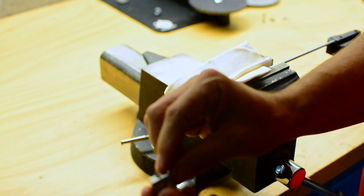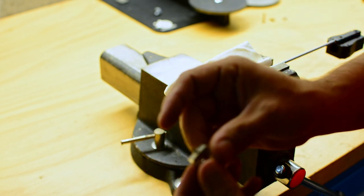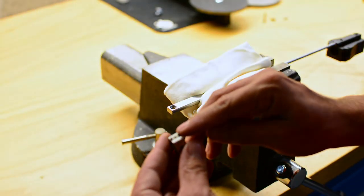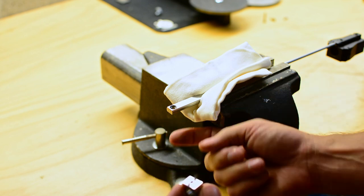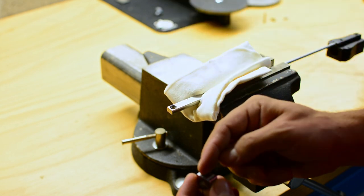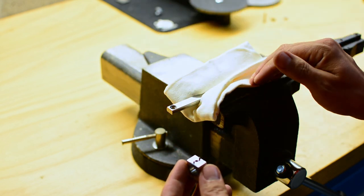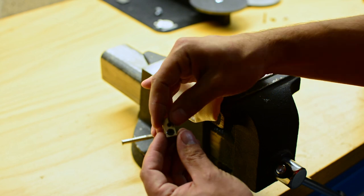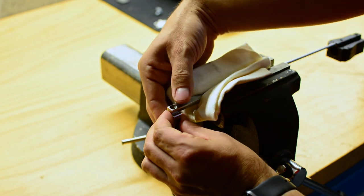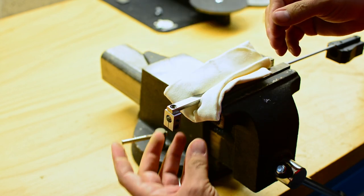That probe has some alignment pins. It seems like there is no second pin, so I'll quickly put one in myself. I now have both pins reinstalled. Those two pins line up with two holes in the bottom of your cocking rail — these two pins ensure perfect alignment so your pellet probe goes in perfectly in line with the barrel. Put them back in. Make sure you put your screw to this side with your block to the front. Locate those two pins and make sure they seat all the way. This ensures your alignment.